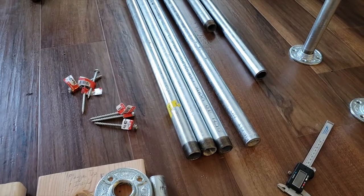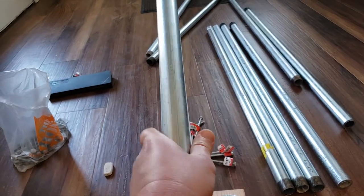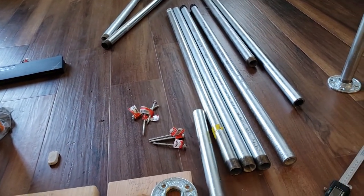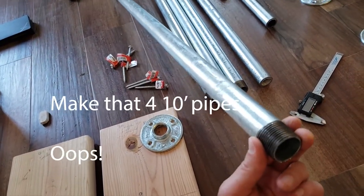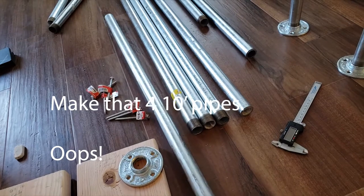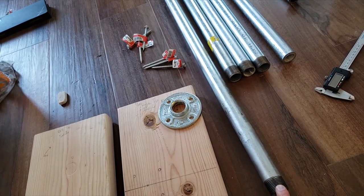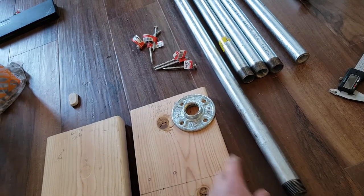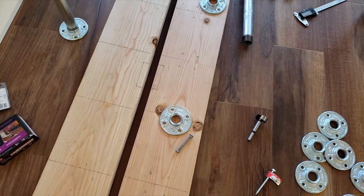This pipe should be a pretty great fit. It's 1-inch galvanized steel pipe, schedule 40, comes in 10-foot pieces. You can get it in other sizes, but if you get three 10-footers they're already threaded on the ends. Have them cut the pipe into 3 equal parts — so 40 inches each. For the center sections, just have them thread one end. Now, the fun part: using the power tools.